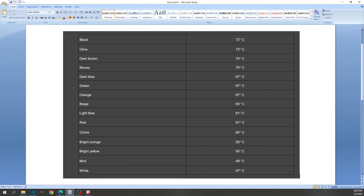Here is an overview for a normal sunny summer day — not extreme. On the left side you can see different colors. Don't wonder what 'mousy' means — it was translated from mouse gray. That is actually my color — my color will be mousy. On a normal day, about 30 to 32 degrees, in the summertime the aluminum heats up to 70 degrees Celsius. Black is even hotter, and comparing it to white — that is way lower because it reflects the sun's rays. Now we know what the maximum surface heat will be on a normal sunny day.